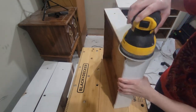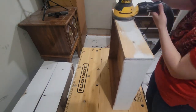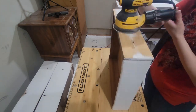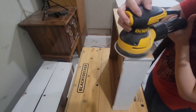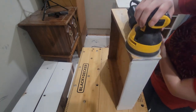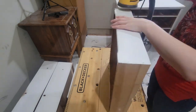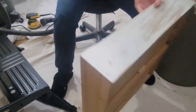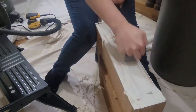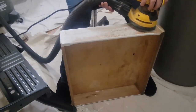Now that everything is prepped and ready to go, I'm ready to sand and I'm using 120 grit. I decided to completely remove the paint off of the two top drawers to see what the wood was going to be like underneath, and luckily it did look good. I also removed the paint off the sides of the drawers — whoever had painted this previously painted the sides of the two top drawers and not the other ones. I really don't like when people put paint on the sides of the drawers. Maybe they did it because they didn't like the wood grain, but I really like it, so I decided to keep it as raw wood.